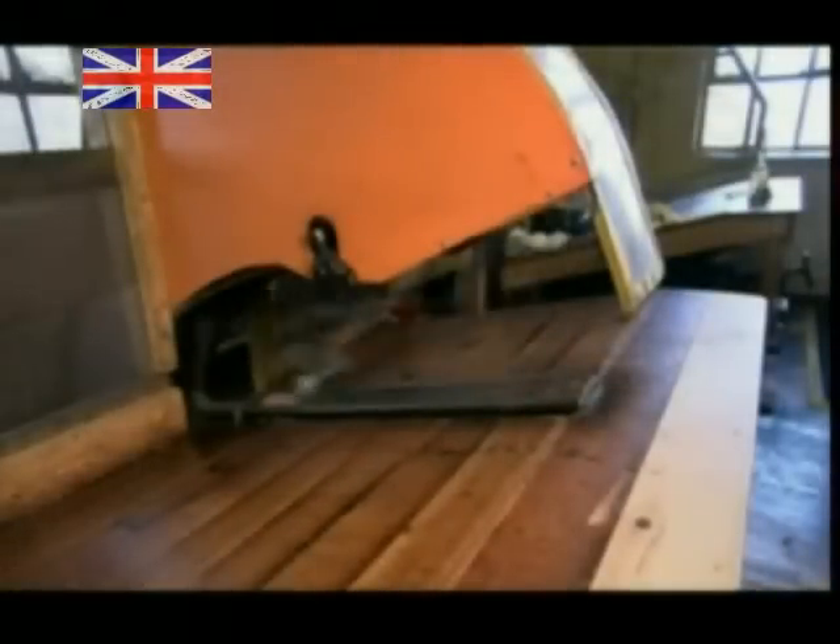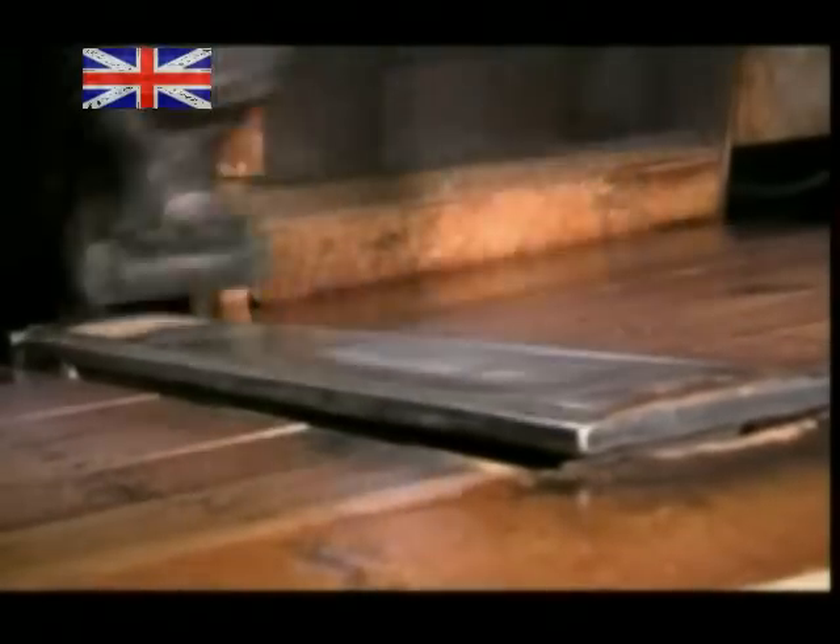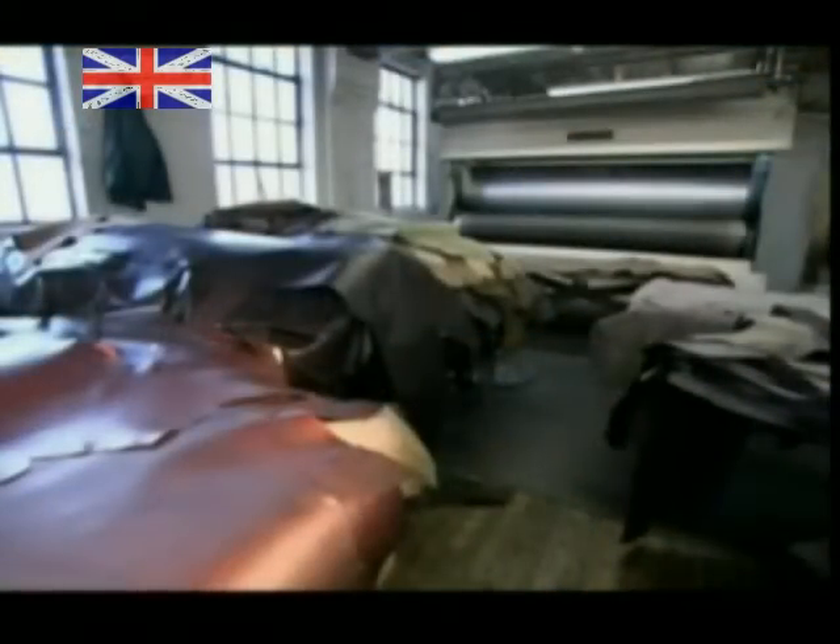And now it's time to create some friction. A glazing jack pulls a glass cylinder over the leather repeatedly, and the abrasive action polishes it. This glass is very strong, so it can do this vigorous work without breaking. Finally, huge heated rollers smooth out any wrinkles.